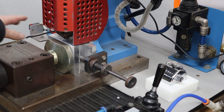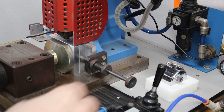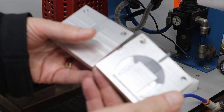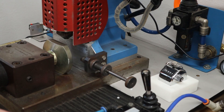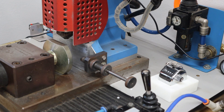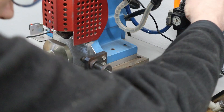I just need to add a little bit of plastic. One of the things I need to do is get an airline run in from the compressor in the next room so I don't have to pause when the compressor starts. Let's see how that shot did — pulling this open, you can see it's not a full shot, which is actually kind of what I expected. I didn't expect it to fill. Getting this part out is a little bit challenging, but using a dental pick makes it easier to pull it out. I'll see how it's like when I fill it completely.